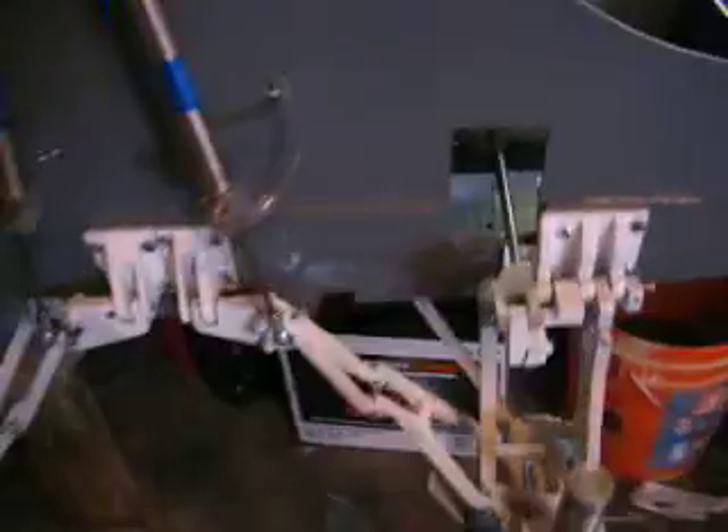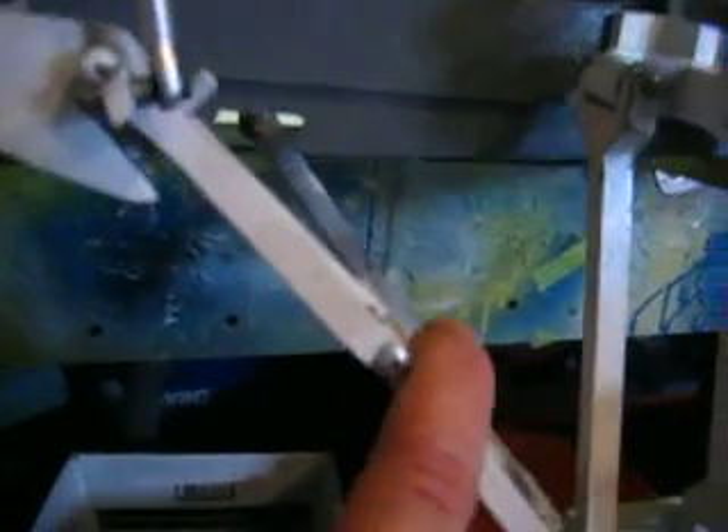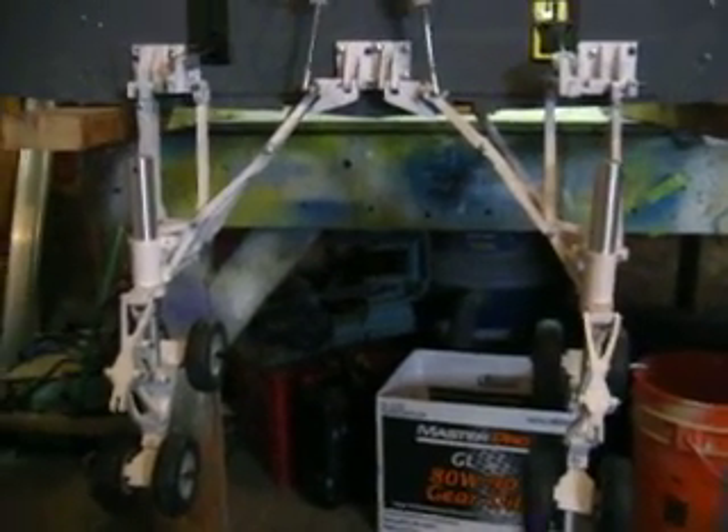We got the air cylinder hooked up. We only have a one-way brake valve at the moment, and we're using hydraulics, so we don't need to worry about buying one. We can raise them up. We got these cylinders here — these are on the locks. Push it down and lock the gear down. When you raise the gear, they'll pull on them and pull them up. These big old air cylinders Dad made actually pull the gear up. They're going to go up kind of hard because we ain't got them restricted, but the hydraulics will slow them down. All right Dad, raise them up.